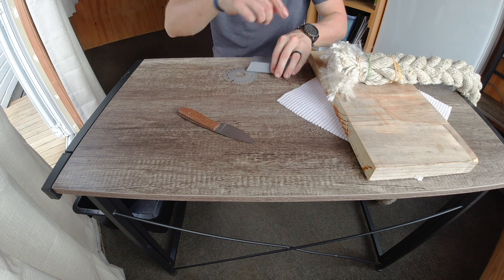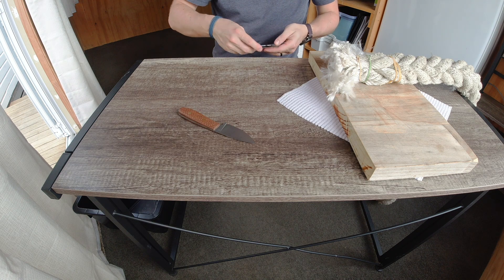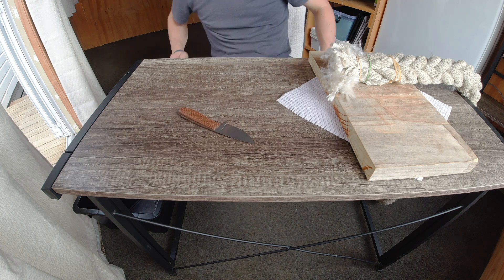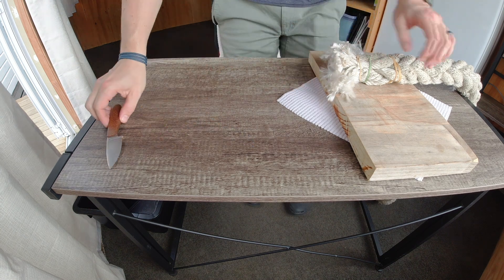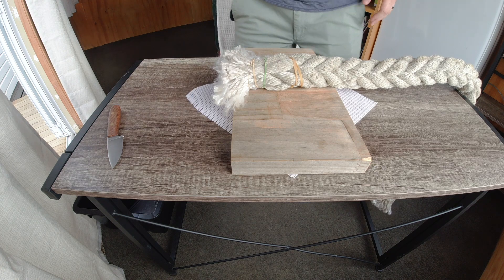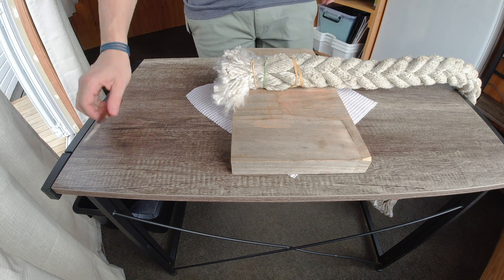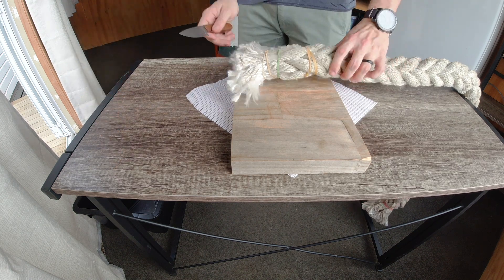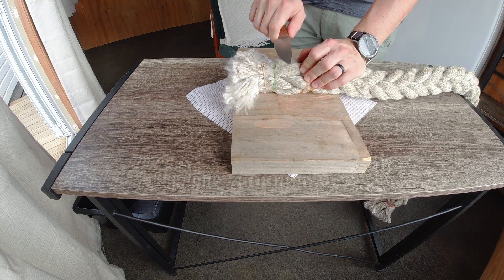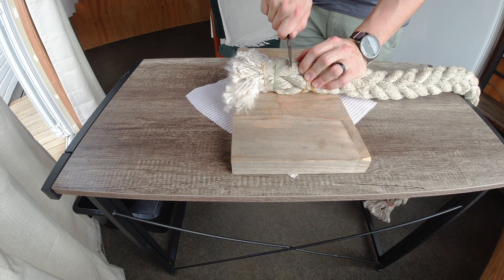There's sand and crud in the rope, so it'll be very impressive if this thing makes it through without chipping on a less-than-5-thousandths behind-the-edge geometry. Our biggest BESS contender so far in this particular test has been CPM Magna Cut in a Mule wearing a dual grit edge, which cut through the rope one time — the BESS reading after was in the upper 390s, just under 397, maybe just under 400. Let's see what this 10V has got at the moment with the edge it's wearing.